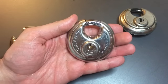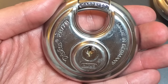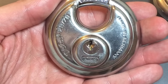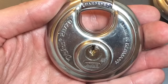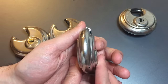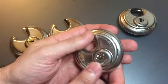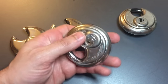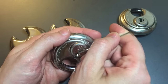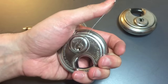This is a lock made in Germany — the Abus Discus Model 2870. You can see it has a little bit of a paracentric keyway that's a little bit harder to get into. It's another four-pin core — probably because the thickness of these locks just doesn't allow for much more than that — and there are a couple of security pins in there, a couple of spools. Let's pick this one open. It'll probably take just a little bit longer than the others, but not much more.